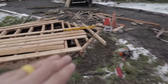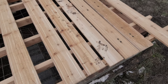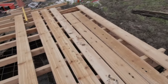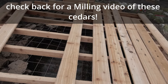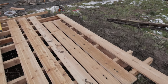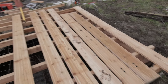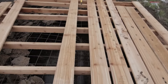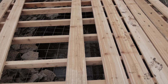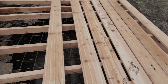I went ahead, screwed all my two by four joists to the frame, and then started laying down some of this cedar deck board. They're full one inch — these are like fresh off the mill. I didn't sand them or anything. I do have my father-in-law's DeWalt planer, so I'm going to send one side through and make them super nice. Because these are hydro poles, they've got bolt holes in them. Normally I wouldn't really care — the spans are tight and the thick wood — but because it's a well and I've got kids playing here, I'm going to get those ones out. The rest of them are all straight pieces, which is real nice. Tomorrow we'll fire up the planer and get after it.